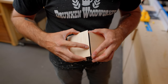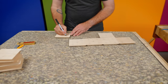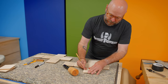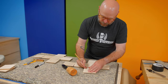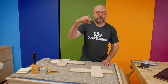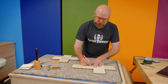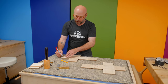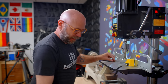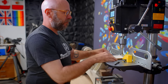It's not all the way to the line, which is okay because we will round that over in a later step. I went ahead and drew all my layout lines and then circled where I want to countersink the holes. I'm going to take an ice pick and just jab the center point — this helps the drill bit position itself in the exact spot. That is a Jimmy Duresta ice pick. Everything is marked, and all the holes are going to be countersunk except for the top piece so it can hold pencils. On this one I want the number five to go all the way through, and on this one I want the three to go all the way through. I've got a fence set up on my drill press for all the corner holes — I can just pop it in there and drill. I'll have to remove the fence to do the center ones.